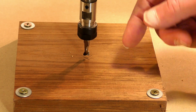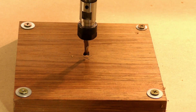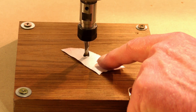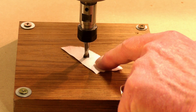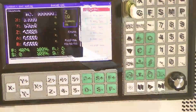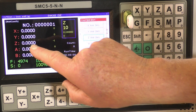The simplest way of finding the end of that tool in relation to the material — the Z zero — is to get a piece of paper, slide it underneath the tool, and then quietly bring the tool down until it just grabs the piece of paper. Move the piece of paper and just feel it — okay, it's got it there. So now we can zero the Z. That's simply done by selecting the Z and pressing OK. Z is now zero.